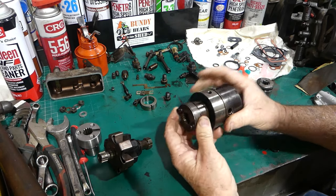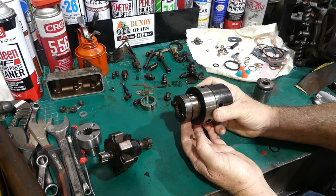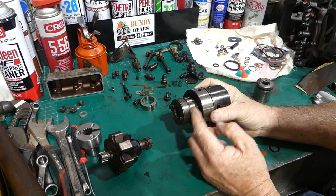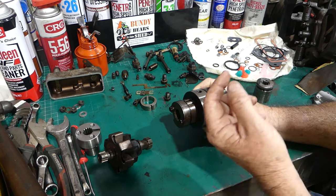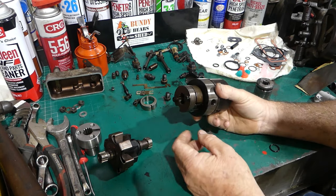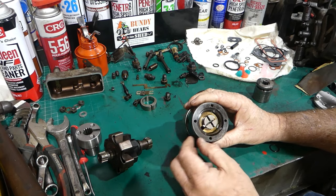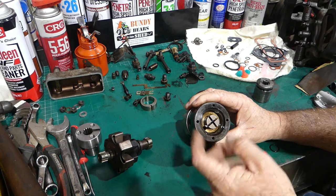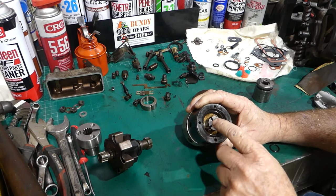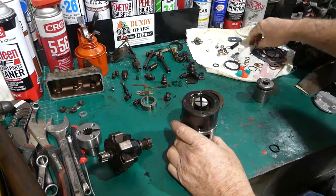This head — because I know those plungers inside are nice and free — if I push the bottom roller up and it stuck there, we'd know there was diesel varnish on the two plungers and they weren't free to move. But that's fine, I'm very happy with it. There's no need to pull that out; normally it's a left-hand thread and if you put a screwdriver or bar in there you'll break it off. I have a proper socket I made for it, but we don't need it — we're just resealing this pump.